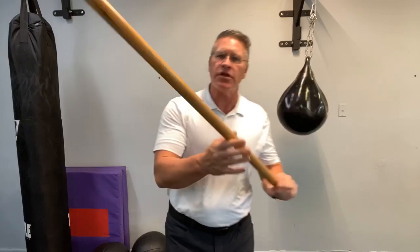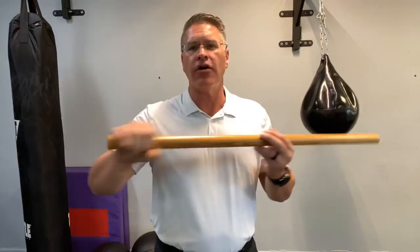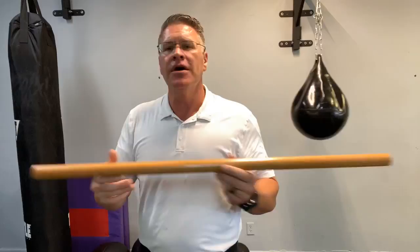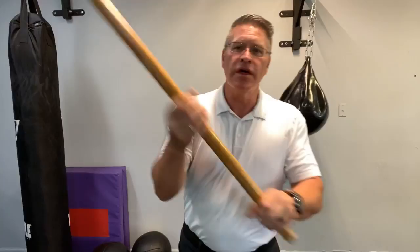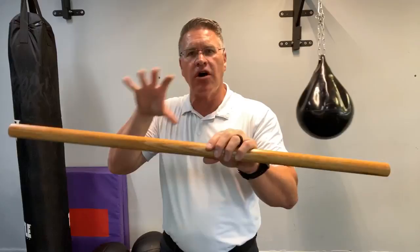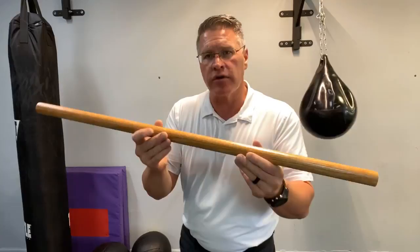I got this one at the local hardware store. Get a couple of pieces of sandpaper — start with an 80 grit, which is very coarse; it's going to take off all the splinters. Then go 120, which will make it more smooth. Just make that sandpaper round and slide it through — it only takes a minute. I've got a couple videos on how to make these yourself for less than 10 bucks. Then go to 220 grit sandpaper to get it really nice and smooth. After that, just every couple days, soak it down with some mineral oil or boiled linseed oil — that gives flexibility back into the wood. They kiln-dry these at the wholesaler, sucking all the water out so they don't rot, so you have to get oil back into it or it'll be brittle and will break. Do that five or six times over a month and it's going to become stronger and stronger.